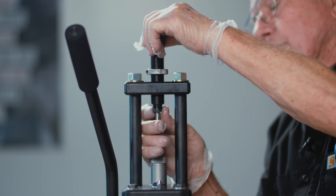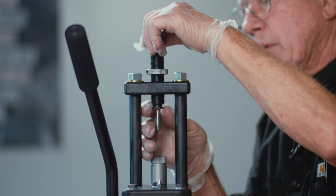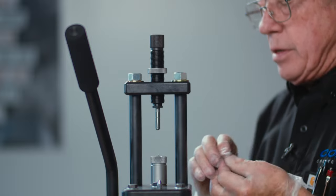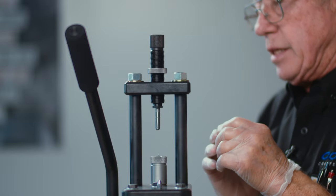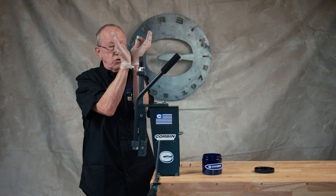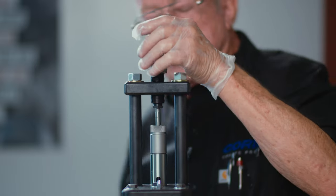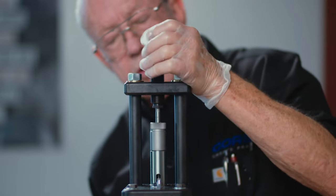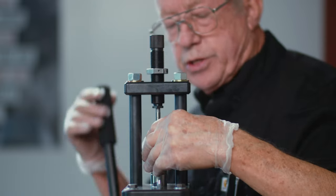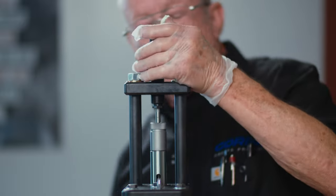It's done for various reasons — sometimes for balance, sometimes just to keep the weight of the pellet down. We're going to take our first one and work it down until we can get that cavity just to close up around the pin and no further. Once we know where that place is, we can lock this punch holder down and then process the rest of them through and they'll all be the same.